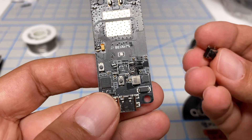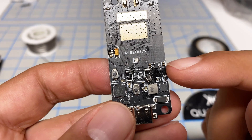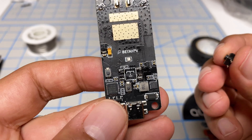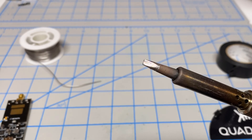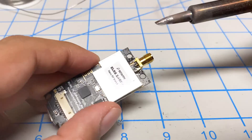The first modification is complete — I got the button off. I just heated up one side and as I was pulling the button, the other side came off. It's not very well soldered down anyway, so you can be pretty rough with it and it'll just pop right off. The key to removal is to use a big soldering tip, which really helps.